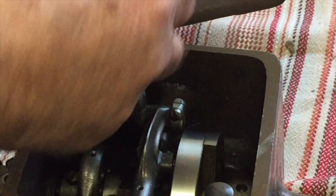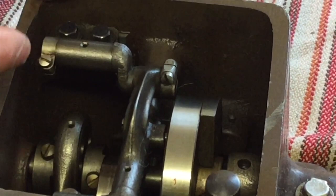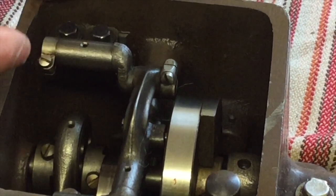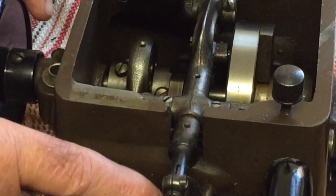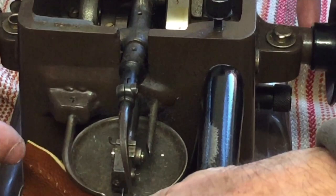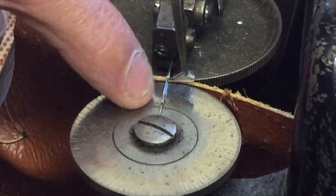These bolts are adjustable — they've got a slot but they don't even look adjustable; the washer is covering over the slot. This will allow you to position the looper from forward to the needle bar position. If you make it too close to the leather, it'll catch the leather as the needles come down. The CCS and SF models have guides or guards because they're doing thicker work — the needle would go down in a groove. For lightweight work they don't need them.